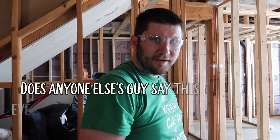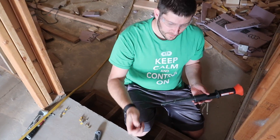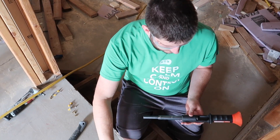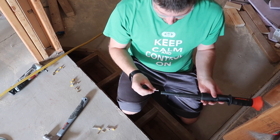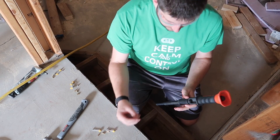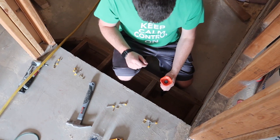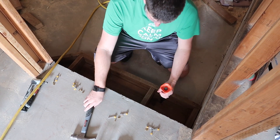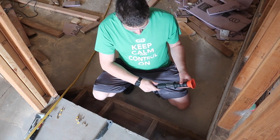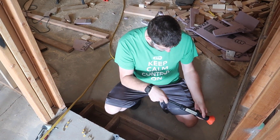Well, that's not going anywhere. This is a nail that you drive down into concrete and you use gunpowder — kind of like a bullet — to do it. I call it a ram-set. You put the nail in, then you put the charge in, close it up, and you put it down on your piece of wood. You have to put it down hard and hit it with a hammer — like a gunshot — and it shoots the nail through the wood all the way into the concrete.